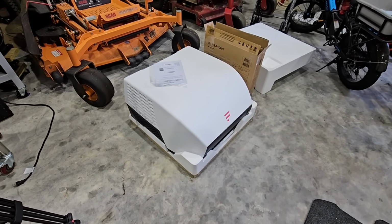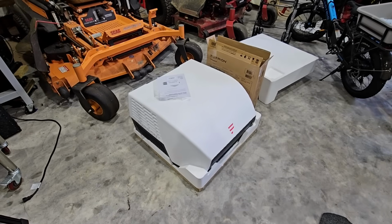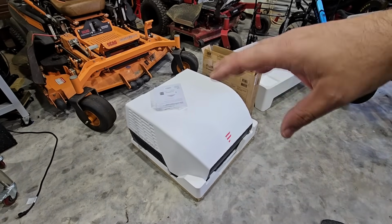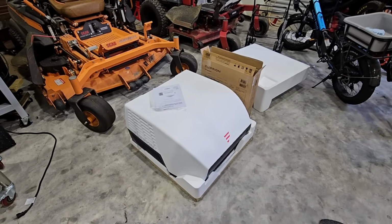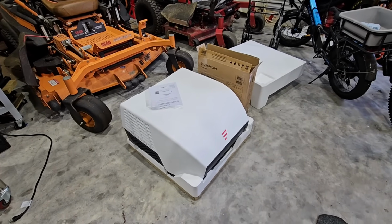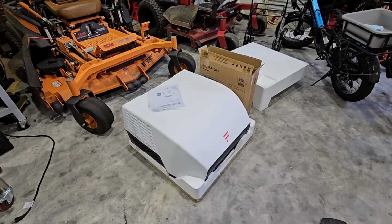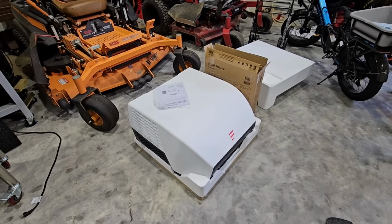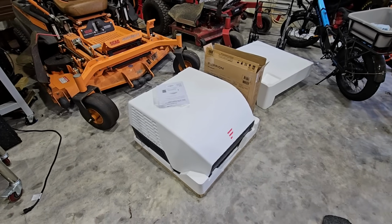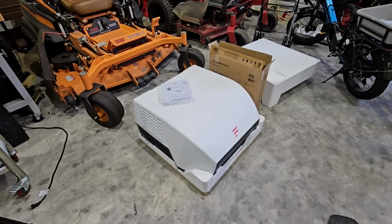So the Surveyor has the Furrion Chill Cube 18,000 variable speed direct fire with the louvers that can move and swing. This one is going to push air directly into the ducting system of the RV, or do a direct dump with the interior panel. So we'll have one or the other option. This one does not have a heat pump built into it, but I've been told multiple times that Furrion will have a variation of this with a heat pump in it as well. But this is not that one.